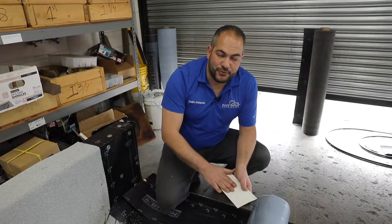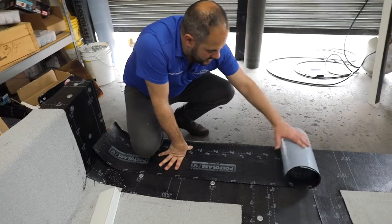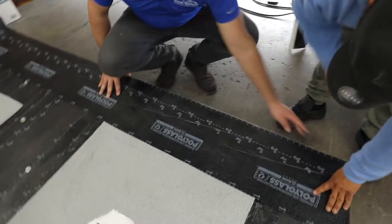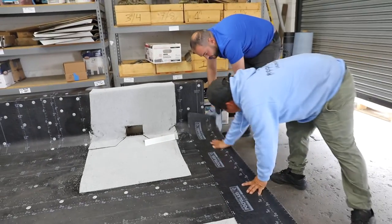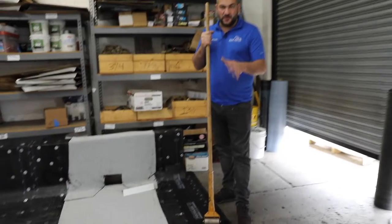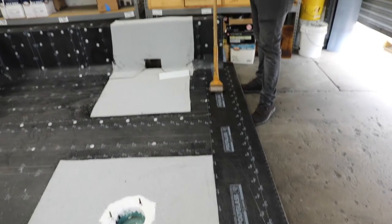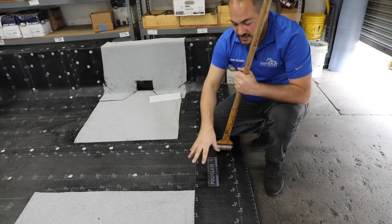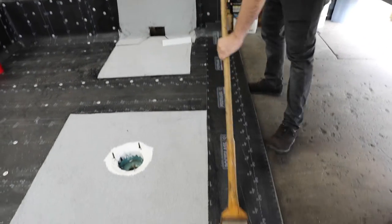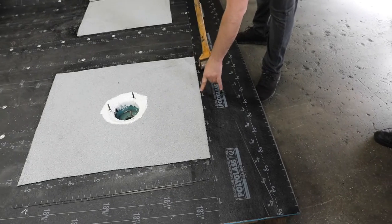Just like any other flashing, we're going to be priming our low-rise before we start. But first, let's install this smooth membrane. You can roll it out while it's laid down into place and just pull the film back from underneath. If you're working with a two-man crew, one person pulls the film off while the other presses it down. We found handy to use rollers for the self-adhered portion — a 4-inch metal roller with a wood end. We really want to focus on this edge, and we'll cut this back right here, as the self-adhered does not adhere very well on the granulated sheet.